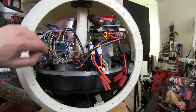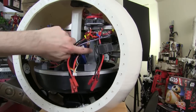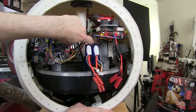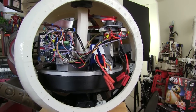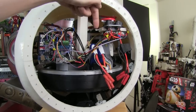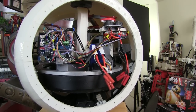What I remembered though was I actually moved this up further than I had to, because I put two screw holes in the side when I made it — you can just see one there, and there's one above it. They're hidden behind those servos, and they're 15mm apart, which is basically why it's 15mm higher — I just used the next screw hole. I only really needed it to move 10mm higher, so what I'm going to do is put it down by 5mm by printing a shim to fit in here and screwing it from the top, and then we'll see if it makes any difference.